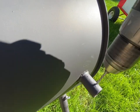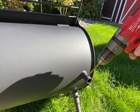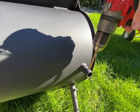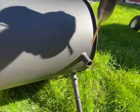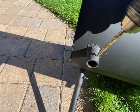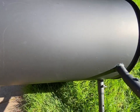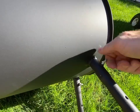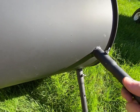Creating the pilot hole, then finishing it up to make it big enough for the actual set screw. Put the leg back on, make sure it's going to fit, crank it down, and it fits super tight - it's not coming off of there.